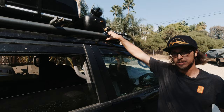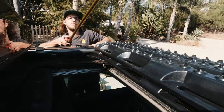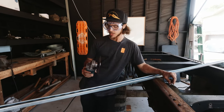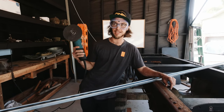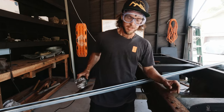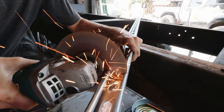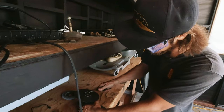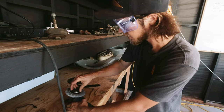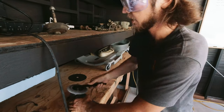We'll be cutting a couple new crossbars to fit up here to mount the tank. So let's start measuring. If you're new to DIYing, you may or may not have one of these grinders or cutters. These Makita grinders — we got a two-pack for like 90 bucks, maybe a hundred. Also if you're grinding, I wear glasses but it's still good to have proper protection on. You always want to deburr your cuts before handling the metal so you don't cut yourself or get metal splinters. It's best to have a grinding wheel and a cutting wheel — you can do it with the cutting wheel but the grinding wheel will do a lot better.